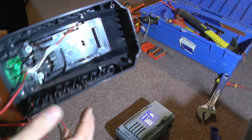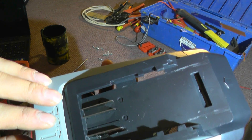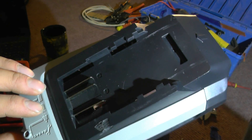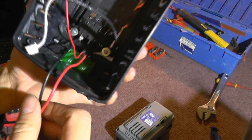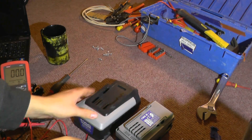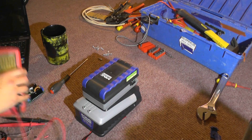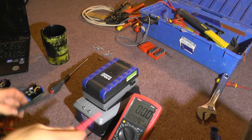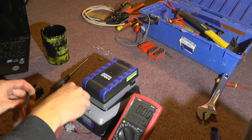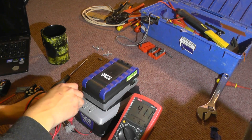So I've finished the modifications. Basically, some idiot cut the hole on the wrong side of the line, so I have made a pig's ear of it. But on the plus side it does work, it does fit. And what I've just done is just resoldered the connector to the connector on the back - we just have two terminal blocks there. For test reasons I'm going to bring in the battery, plug that in, bring the meter into view, and the two terminals. Positive, negative - and then we have 41.1 volts. Okay, so that is working as it should.